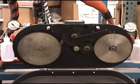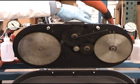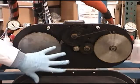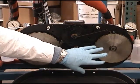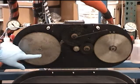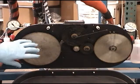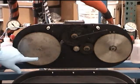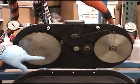And the ratios change. Let's say, for instance, the machine has a 6 cc per rev output on this side and a 6 cc per rev output on this side. This configuration has a 100-tooth gear on this side, so each revolution will produce 6 cc's. We put a 112-tooth gear on this side, meaning the isocyanate will be reduced by 12%. Instead of putting out 6 cc's per rev, it'll now put out 5.28 cc's per rev.